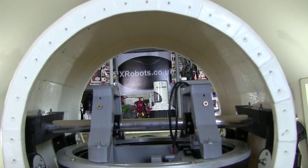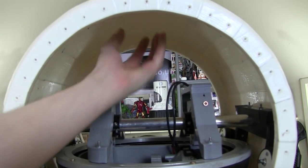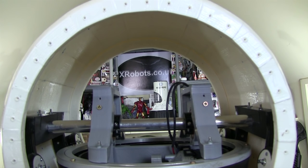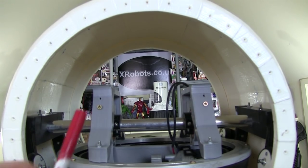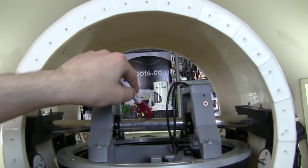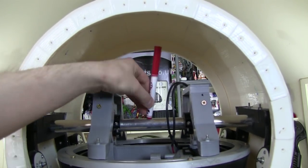In a similar fashion to version 2, my head control arm is of course going to have a magnetic coupling at the top which grips the head from the other side. I'm going to make the head control arm a lot lighter and a lot simpler for this. I had fairly large 3D printed gears, 2 servos, another motor with 3D printed gears and all sorts of things. This one is going to be a lot simpler, so all I'm going to do is build a gimbal around this middle, which is why I've left this piece completely blank, to make a stick that sticks up, and then I'm going to push it around.